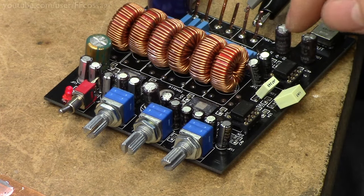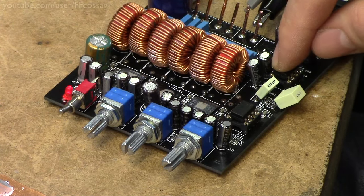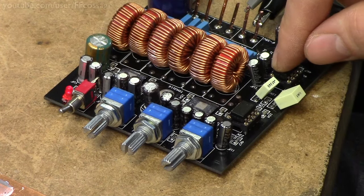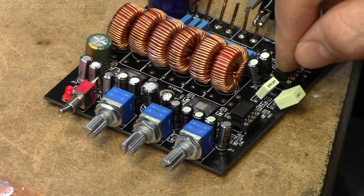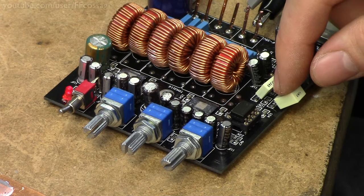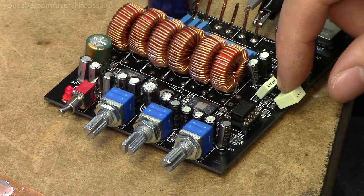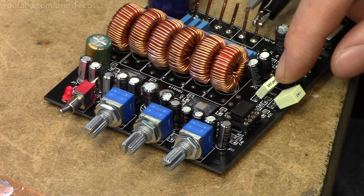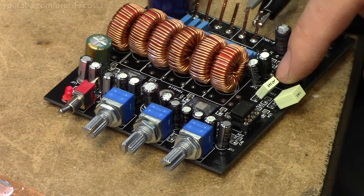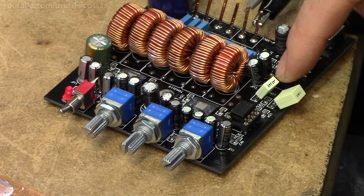The real big issue seems to be in this op-amp circuit here with regards to the low-pass filter, because I'm not really certain how they've done it, but they obviously implemented an extremely unsharp filter. I removed these two capacitors, and underneath them are actual labels for what the designer intended the values to be, and that would be 0.22 microfarad there and 0.1 microfarad there. The board had 0.22 microfarad installed on both positions originally, and that gave a stupid high cutoff frequency,